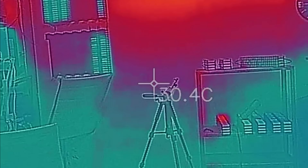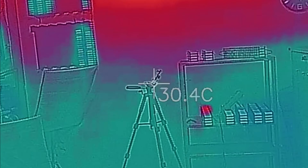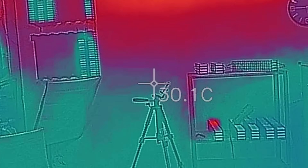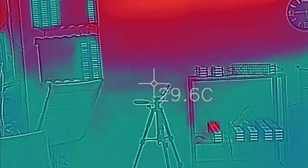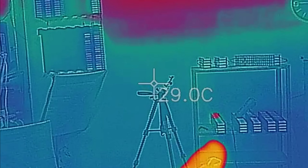The load on each of these batteries may have exceeded — maybe not the cell's recommendation — but practical limitations for accumulated heat and stuff like that. So even from back here you can see the problem. I've taken the worst ones out and put them outside, but can you see just here? There's a hotspot.